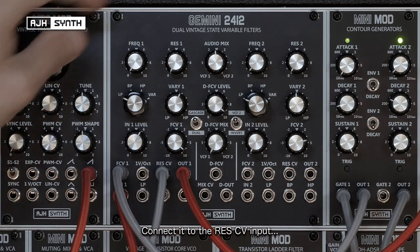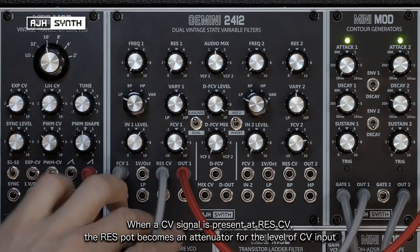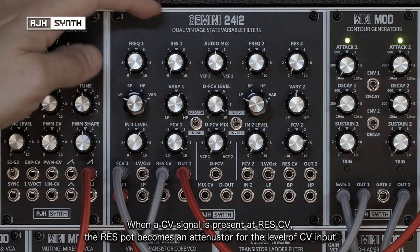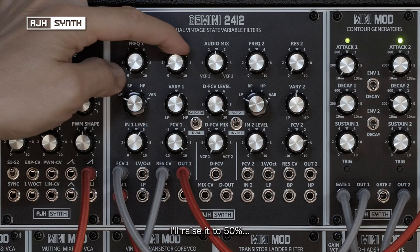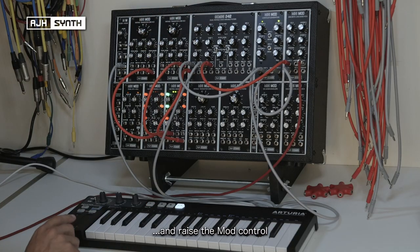Now, whereas normally this pot would control the amount of resonance, when there's a signal present at the resonance CV input, this then becomes an attenuator for the amount of CV influence over resonance. So if I put this up to 50% and increase my mod control,